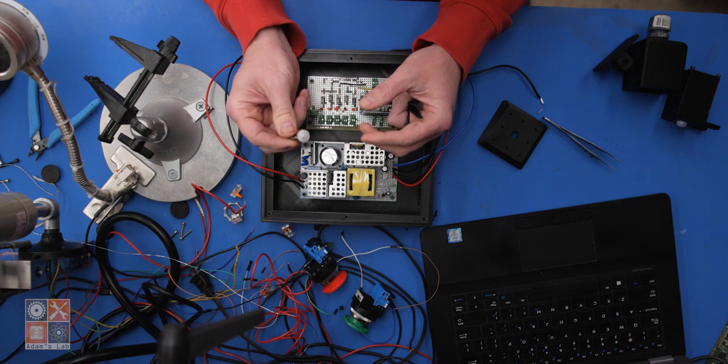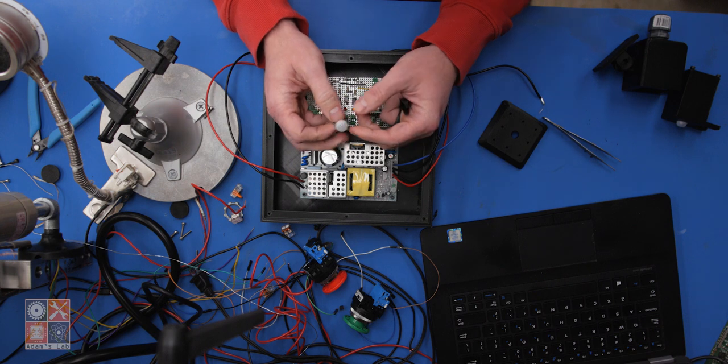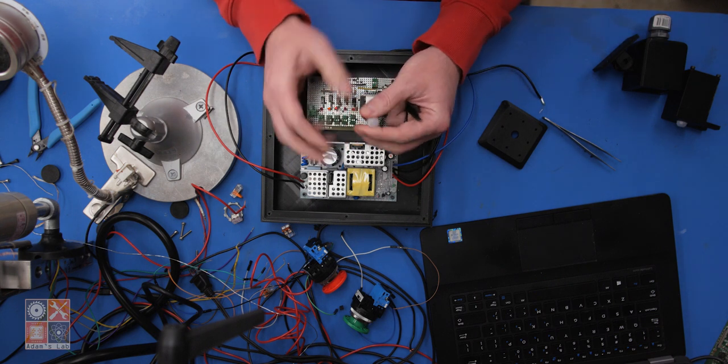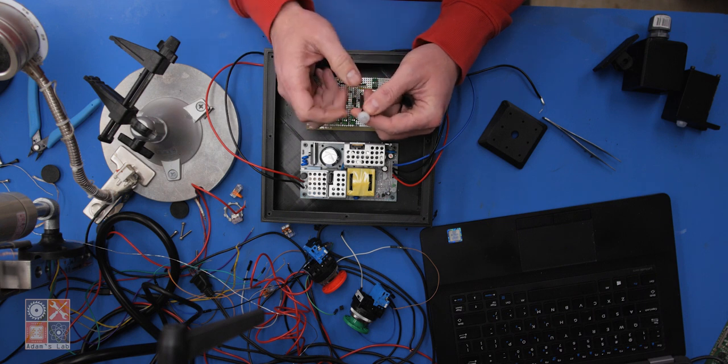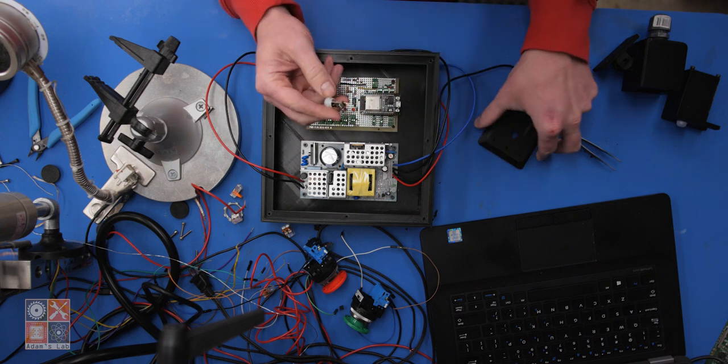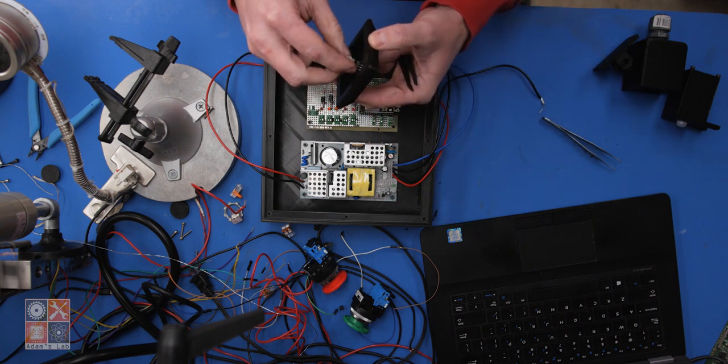The only gotcha, if it really is one, is that the output stays high for about a half a second or so when it detects motion. So if it detects motion and that motion goes away, the output will stay high for a bit. It's not a big deal, but it is something to be aware of, and you could always program around it if it was an issue.